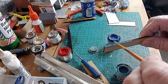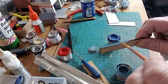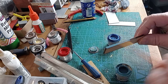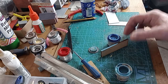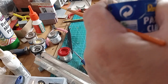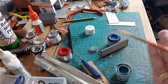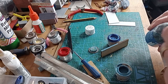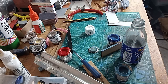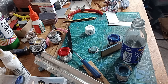Then the next step will be the gloss paint on top of this when it dries. So that's put on there and you can see straight away — in a minute when I do the opposite and put the gloss paint straight on there, you should see the difference. You'll find that some of it will fade away, but it will leave enough coating on there for the next coat of paint to actually start to colour it, which is what you need. So we'll just clean that off the brush.